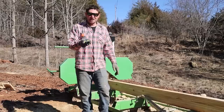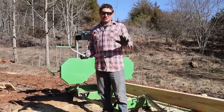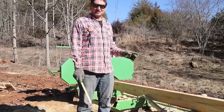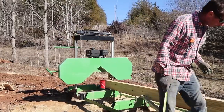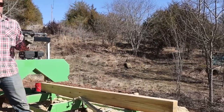So the poplar logs that have been sitting around here for the past year, I never got a chance to mill them all, and they're rotting from the outside in. There's still some good wood on the inside. So what I'm doing looks very wasteful, but I'm selectively using the inner part for 4x4s, because we're building a deck.